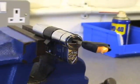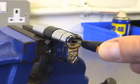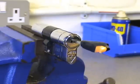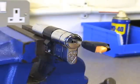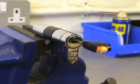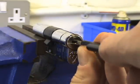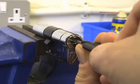What I have to do, however, is make sure that that key is pushed in. I don't know if you can see, if I push it then let go, it springs back out. So I just need to make sure that when I'm picking, that it engages into that cam. So I'm just going to use a basic little spade pick. I'm just going to push the key in, apply a bit of slight rotation, start to go into the lock and start to pick these pins.